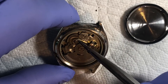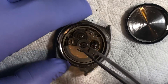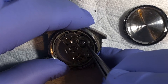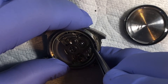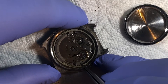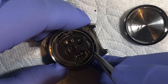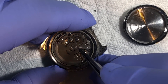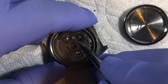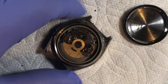A little hazy; we've got a lot of wear on the top of this ratchet wheel. That's been getting worked on. This thing looks good — obviously it's a runner. That's pretty loose though; we'll probably have to replace that winding weight, it's floating all over the place.